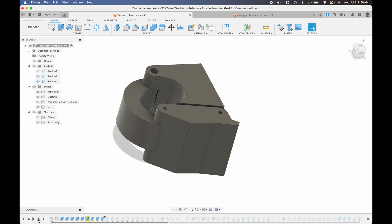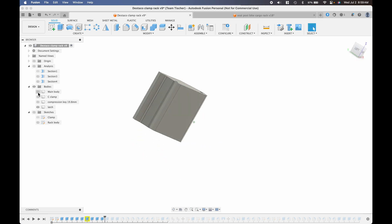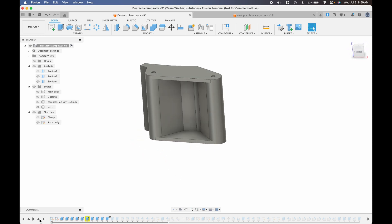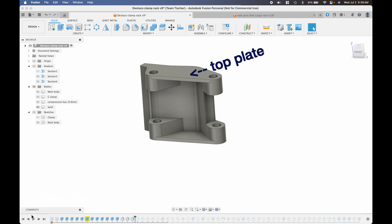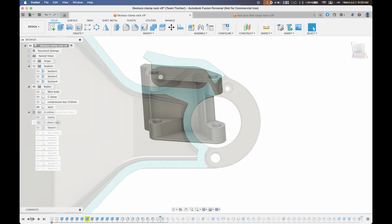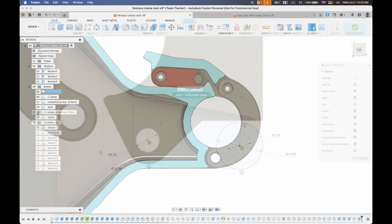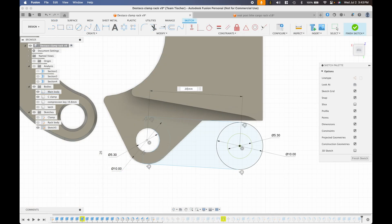This final piece needs to be really rigid because if it bends at all, the latch could come undone — it might bend past the over-center threshold for keeping it latched. For this reason, I have a plate on the top and bottom that connect the two hinge points in tension and reduce the bending load in the latch. This final piece in the middle is in pure compression when the latch is closed, and I can change the length of that to account for different diameters of seat posts.